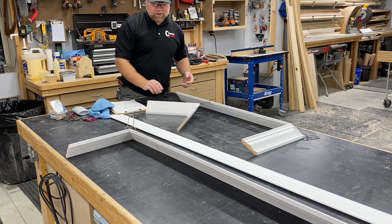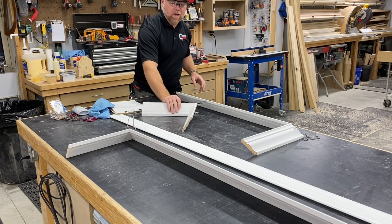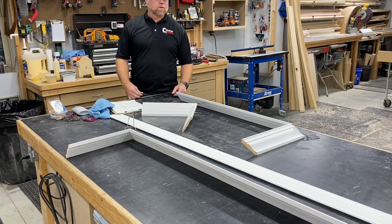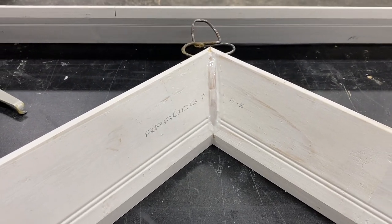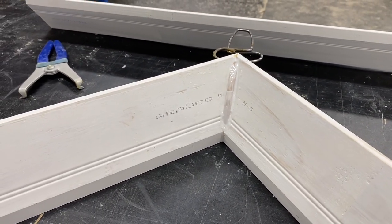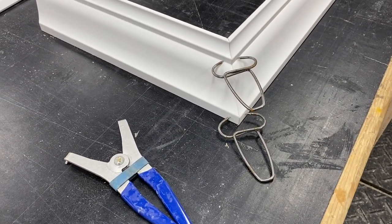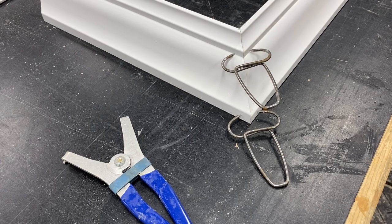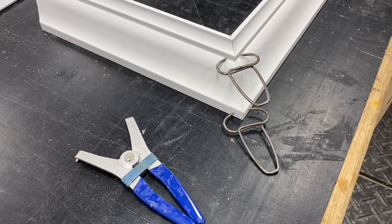That pretty much wraps it up. I'll try to grab some finished photos of this crown either after it comes out of paint or maybe even after the install, to show you the finished results and the real reason why we do it. I hope you found it helpful, and thank you for watching. Here you can see a close-up shot of the reinforcements we've added to the back side of the miters. Here's a shot of the Collins miter clamps in action — they leave a very minimal hole, no more than a pin nail usually. A little touch-up and it's good to go.